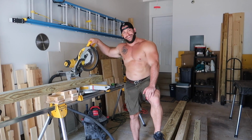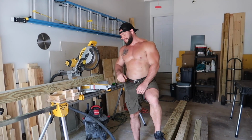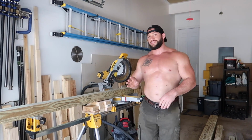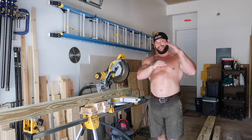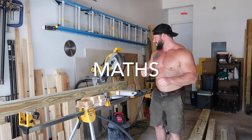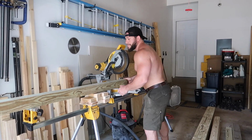What's up, everybody? Today, we're going to make a stone loading platform. We start by cutting our 4x4 posts. That's basically the legs that are going to stand up. We're going to cut 8 posts. This is going to be a 48-inch platform, so we're going to start by cutting our 4x4 posts to 46.5 inches. That's going to leave room for another 1.5 inches of plywood on top of this thing. Total height, 48 inches. So let's start by cutting.